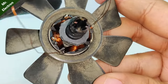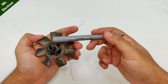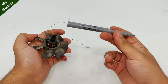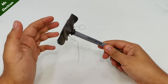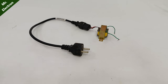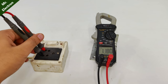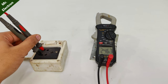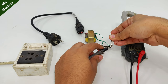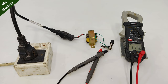Let's try it on AC supply — 12 volts. For this experiment I am not going to use the tapping points, only the end points, these two wires. This is our 220 volts to 12 volts transformer, and that's our 220 volt home socket supply — as you can see, 246 volts. Now that I have connected the transformer in between, the output voltage measured here is around 12 volts AC.